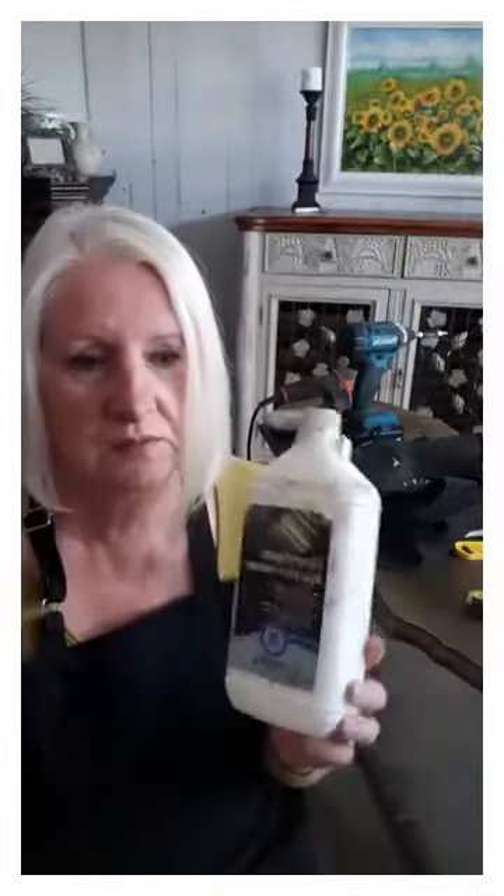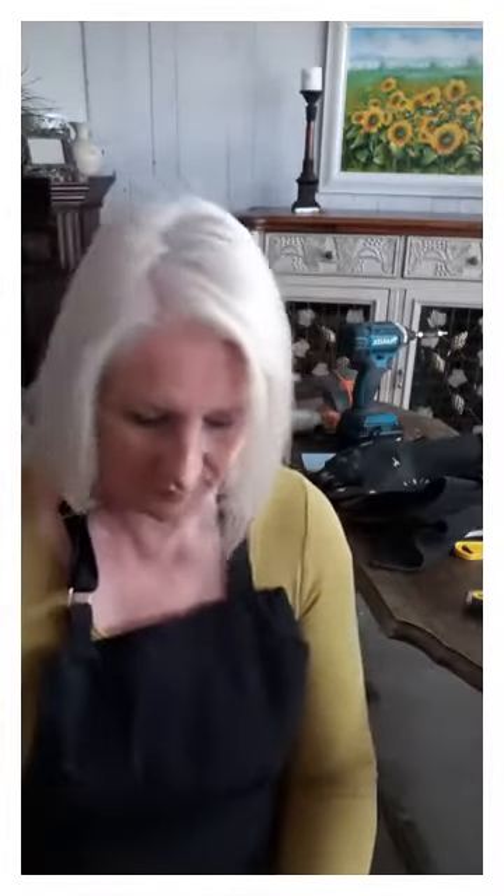It says 15 minutes on the jar, but I always find about 10 minutes max is what it takes. If you have a piece with a thin layer of varnish and it's a fairly new piece, it'll go pretty fast. This has a few layers and it's kind of old and crusty, so I might need two coats. Once I'm done with the paint stripper, you have to neutralize it with either soapy water or mineral spirits. I use mineral spirits because if you use soapy water, your wood gets wet — you're dealing with bare wood — and you have to let it dry several hours. But if you use mineral spirits, this stuff dries in like five minutes.